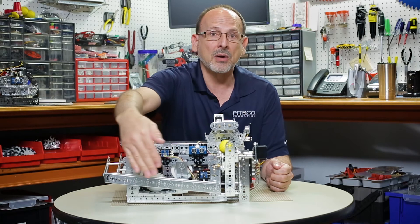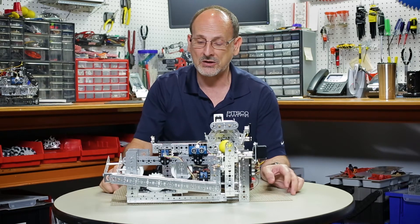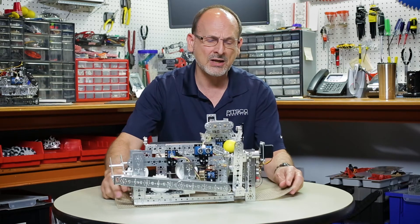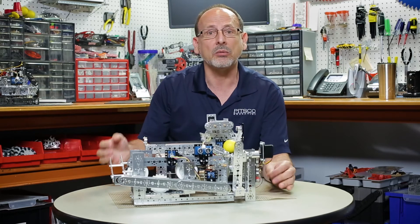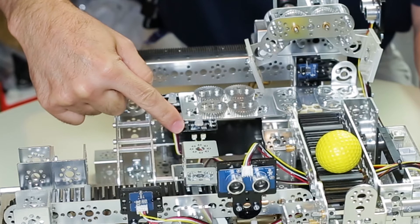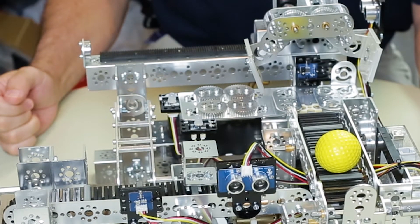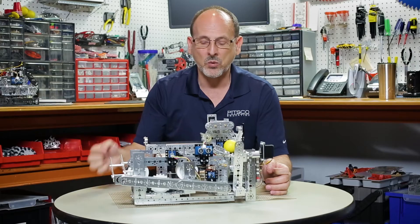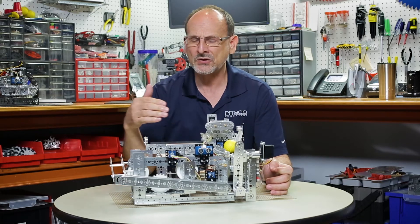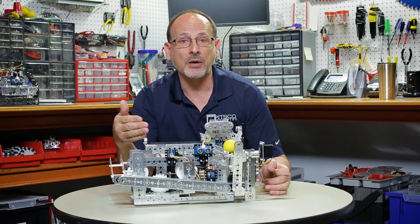This other ultrasonic is acting as the overall master switch — when I move my hand or a body stands in front of it, that activates the whole process. I also added two RGB LEDs right down here to simulate what a process might look like and to demonstrate when that process is finished.